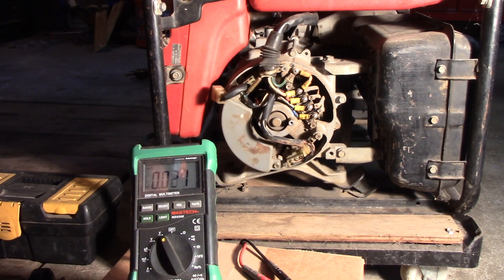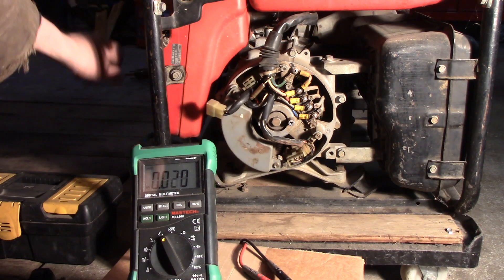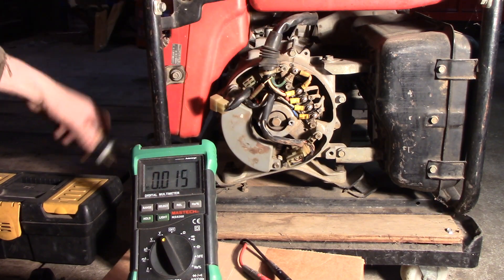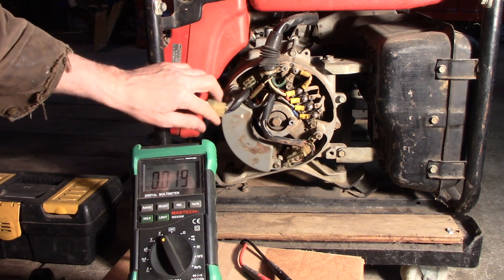Wow — so 13 volts on the brushes. I'm curious whether all generators are the same, because what I looked up said no more than 10 volts and I'm reading 13 volts. That being said, let me plug these back in and check the measurements across those terminals — looking for two to five volts on each pair. I got two and a half volts — same thing on both sides. But this thing did not produce power this morning. Nothing was coming out, and this indicator light here — nothing was working. I measured all the outlets — this thing was not producing power.